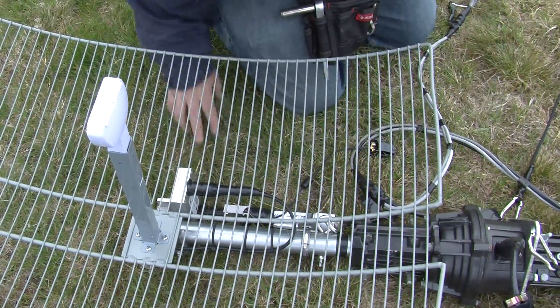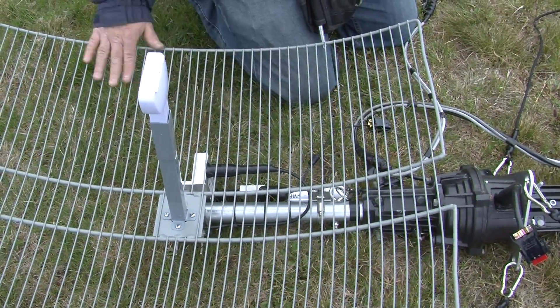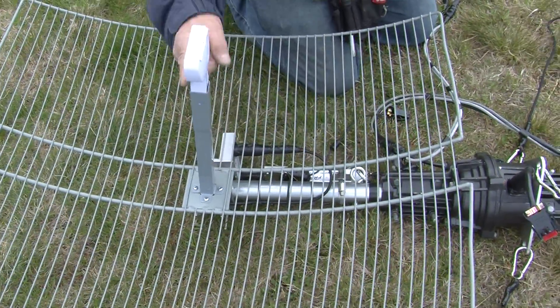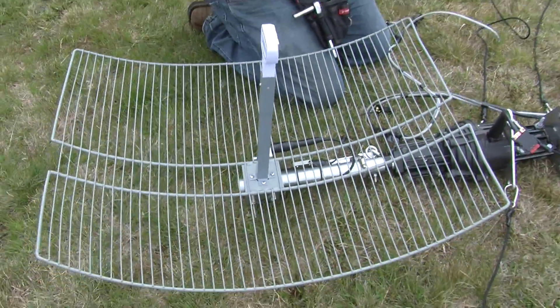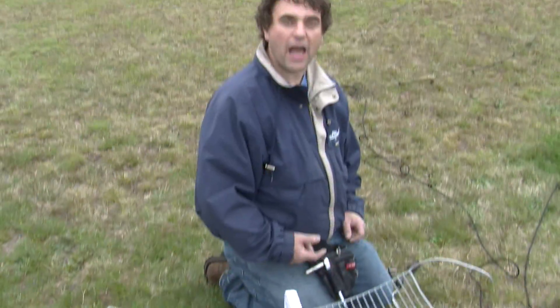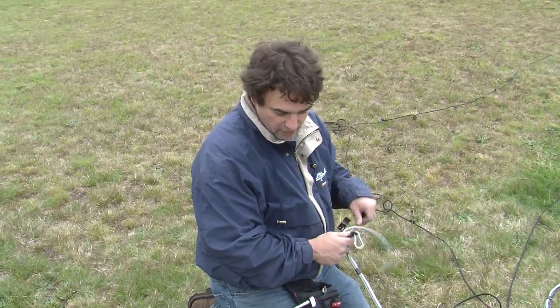There's a four-watt power amplifier. We've got minimal loss because we're not doing any RF down the wire — there are no coaxial losses. The only piece of coax is this one little piece that goes from the amplifier into the antenna; it's only about three feet long. This dish focuses the energy and actually takes this four watts of power and makes it look like a thousand watts because of the focusing and amplification.